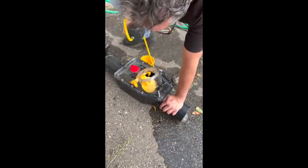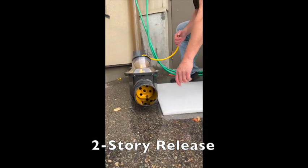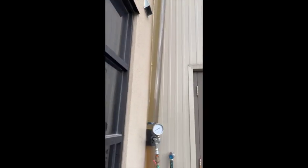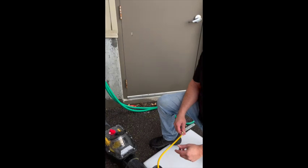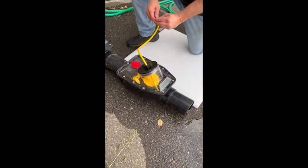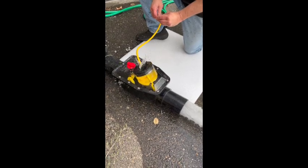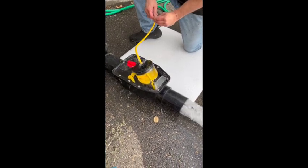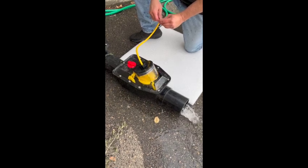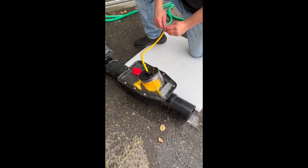And that's another unit. You can see this strainer plug — it is going to stop the test ball from going through, and it's going to let the water drain. We've got a 25-foot head of water there. I'm going to release it now by simply releasing the air out of the ball. All the system is drained; make sure all your air is out of that ball.